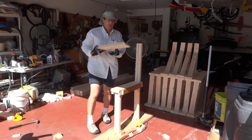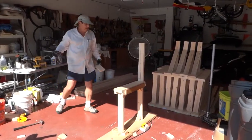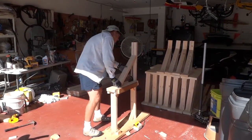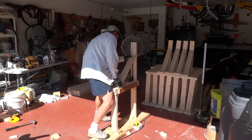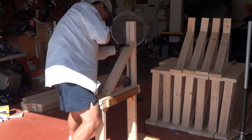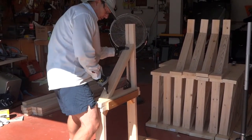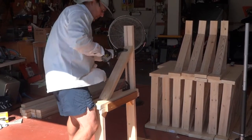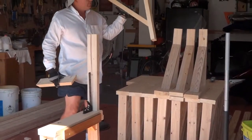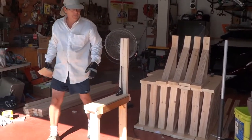You set up a jig to do your cross braces at a 45. Put the square in here to make sure it's right. You hold these in place, make sure it's square. And you mark your spots here and here. Pre-drill so you don't split your wood, then put your screws in. And you end up with a perfectly square bracket for mounting that forms the cap for the seawalls.